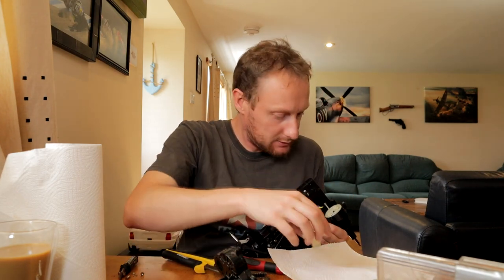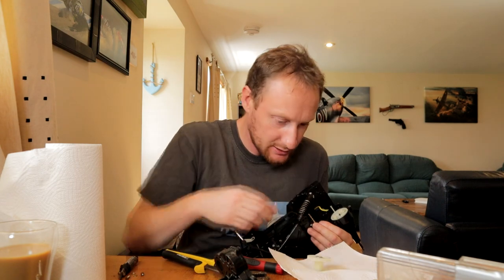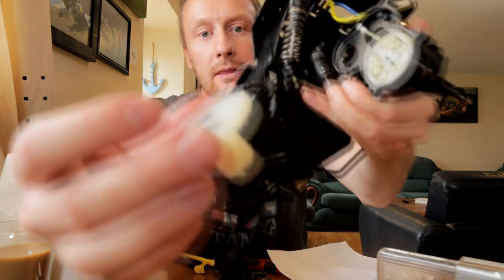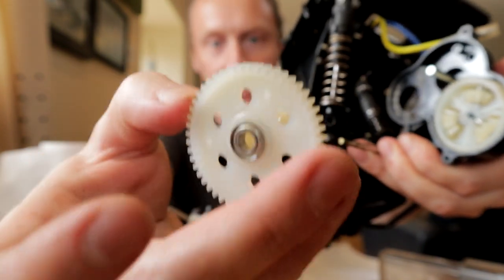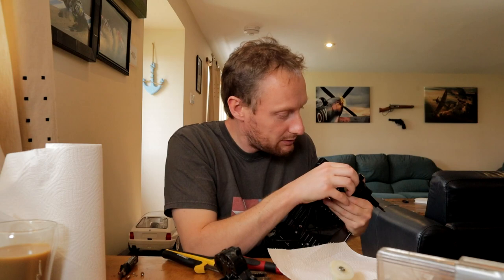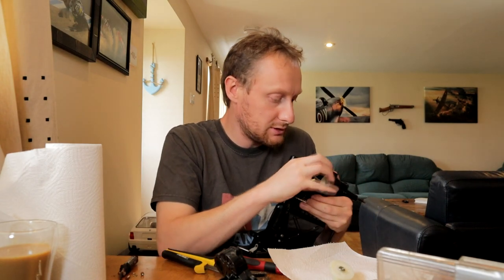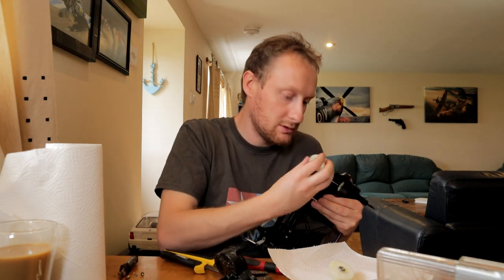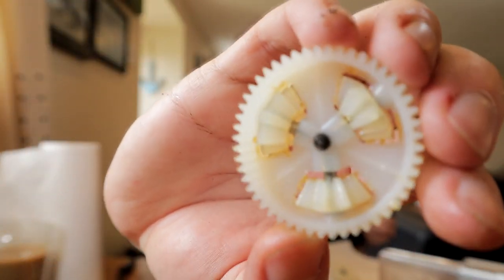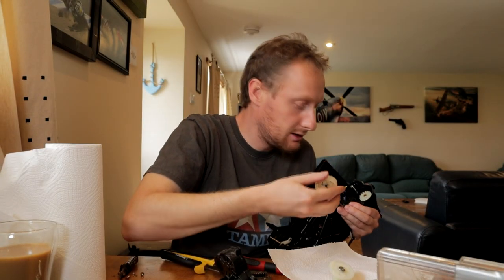Well, it's not too bad. Not too bad at all. It's very dry. Thankfully, it looks like it's sealed. Yeah, you can see that, they're clean. So it has sealed, thank goodness. So there's no horribleness, but it is dried out. You can see the remnants of the old grease on this one. So I can pull this out. There we go. You can see on the planetary gears there, there's lots of dried yellow grease. So that's old and out of date.